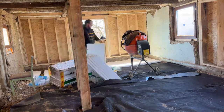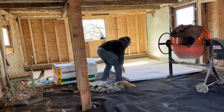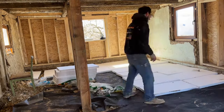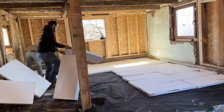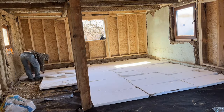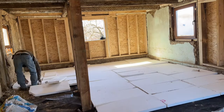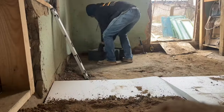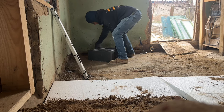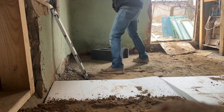Then we got to work at the concrete floor. First of all, I put a vapor barrier down and then put five centimeters of foam, so hopefully the heat from my pipes doesn't just disappear down into the ground. We laid this down — it was a little bit of a pain, and we did run out of the foam, but I was able to get some more. And while I was getting some more, we got to work at the fireplace.